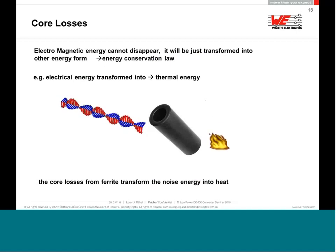But believe me, even if you use a very, very sensitive, good thermal camera and look at your USB cable or VGA cable and want to see the thermal heating generated by the EMC noise, it will be impossible because it's so small and only reproducible in a laboratory. If you ever produce a device, especially a power supply, and you put a ferrite core on the wire and this ferrite core starts to run hot, then I want to say it is no longer an EMC problem. You have a safety problem, and I recommend you run away as fast as you can, because this is more like 10, 20 volts per meter. If you make the ferrite hot, it is 200, 300 volts per meter, and then this is a safety problem, not an EMC problem anymore.